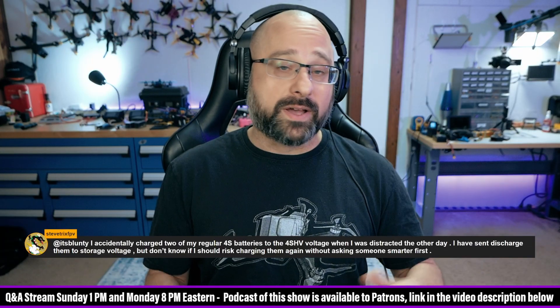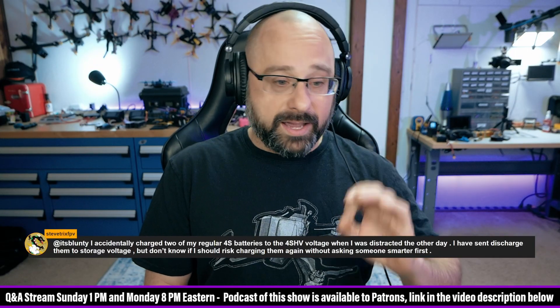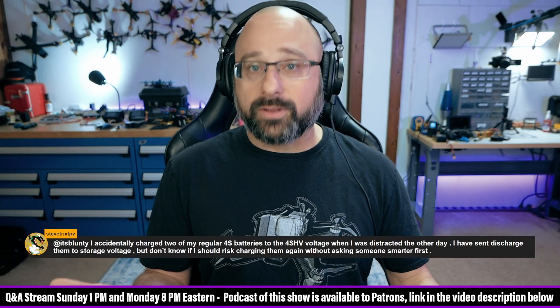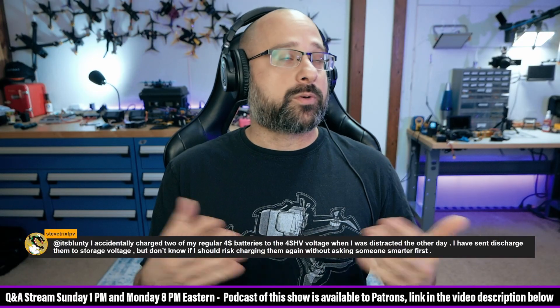Safety warning — big yellow flags around everything I'm about to say. You can overcharge basically any lipo to 4.35 volts. I'm not saying that you should. I'm saying that I've intentionally overcharged lipos with the intent of lighting them on fire for the sake of doing a demonstration, and I have never had one go before 4.5 volts.